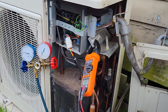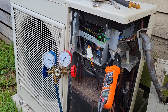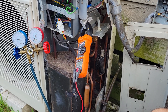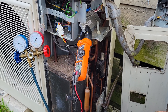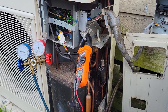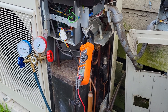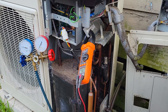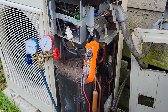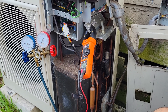Hey, what's up YouTube. I think I got a pretty interesting and helpful video for you today. Working on a Daikin mini split and the failure ended up being the EEV coil — tested it out with ohms and it tested bad. Problem is my supply house said the thing was on backorder for a month. Well, we're in summertime now, it's regularly hitting 95 degrees and this is the main AC for the home, so this thing just couldn't be down for a month.